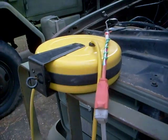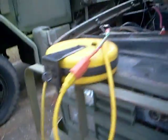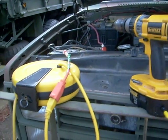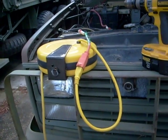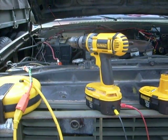I'm going to go ahead and hook up the other extension cord. I'll hook the other extension cord in and pull the trigger. Now as you can see it runs a little bit slower with the longer cord. What happens is it's called resistance — the longer the cord and the thinner the wire, the slower the drill is going to run. It's just like putting a resistor in line. If you use a thicker extension cord like a contractor's cord you won't experience that problem.